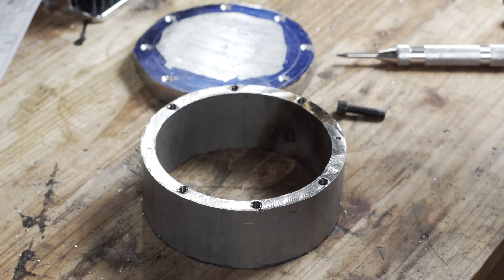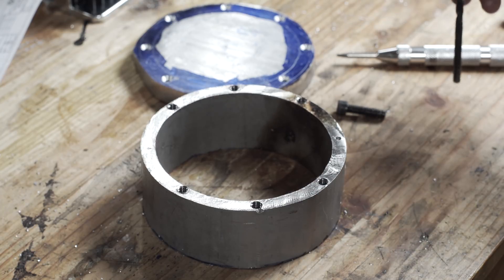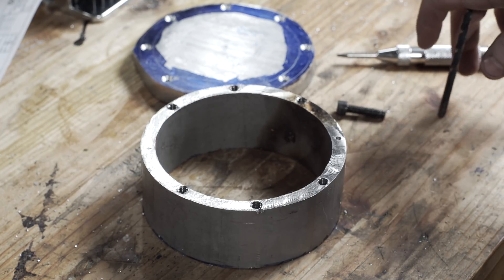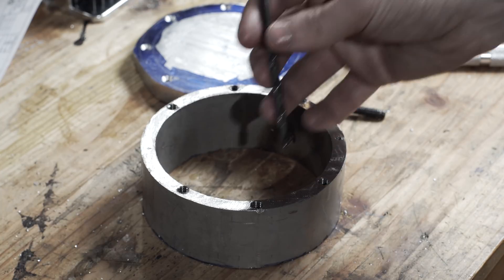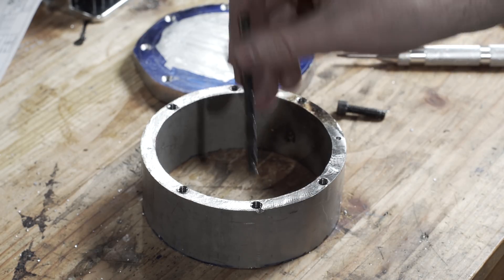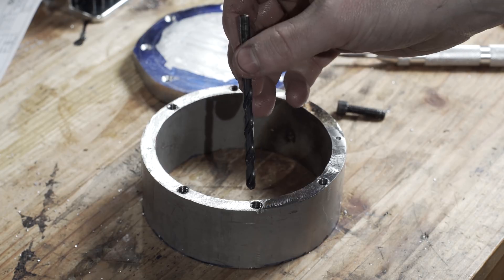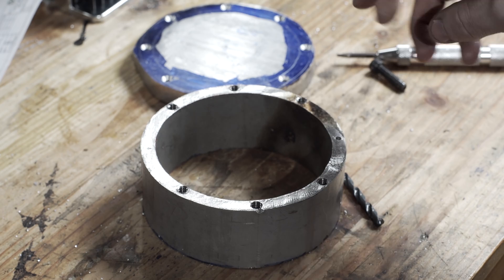I learned that stainless work hardens really quickly. If you don't have a super sharp drill bit, it work hardens and then dulls the bit further — a quickly escalating problem. I learned how to grind at least a passable new edge onto the spiral points using a pretty janky Dremel setup, since I don't have a bench grinder. On my mill, once the bit started cutting and pulling out a chip, I found it best to just let it keep going as long as possible. Pecking made it much more likely to start spinning on re-entry. Good workflow: get it going, give it steady pressure, break the chip before it gets too long, then restart.